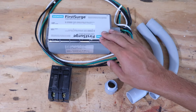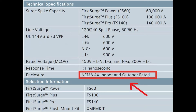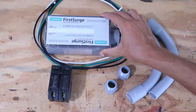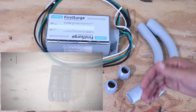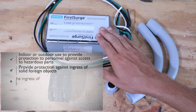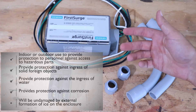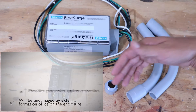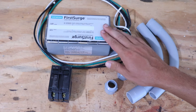This box is rated as a NEMA 4X rating, which means it can be mounted indoors or outdoors. NEMA 4X is rated against a whole host of possible intrusions, so it should have no problem being mounted outside. If water is constantly cascading directly onto it without any eve or gutter cover, you might want to think about adding an additional enclosure, but for most situations this should be fine.